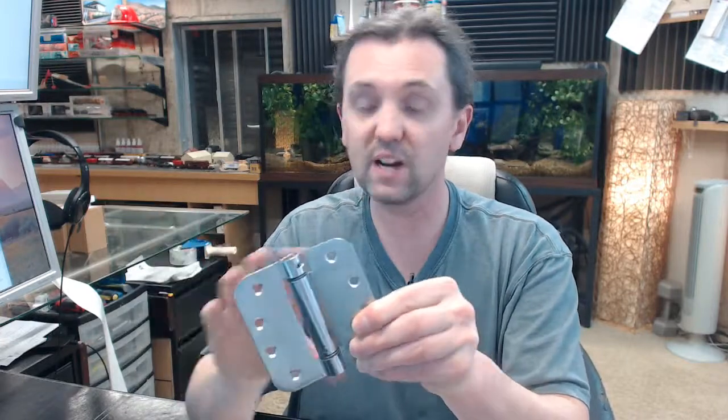The spring hinge is, in my opinion, a pretty inefficient way to handle a door, and that really doors need to be hydraulically controlled. Door closers, surface-mounted door closers, overhead or floor-mounted door closers. However, that's not practical in a lot of applications, and you could have a condo building where you've got 90 units, and the front of all those unit doors, they're not going to have door closers on them. They're going to have spring hinges.